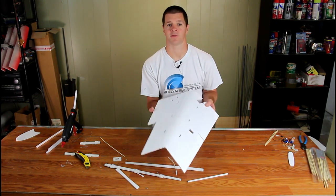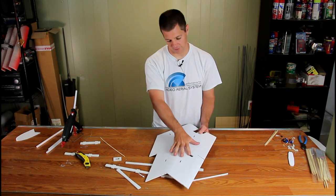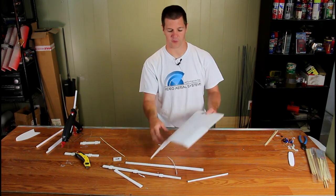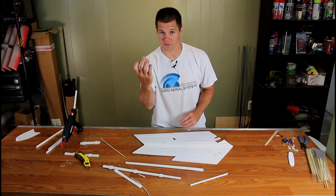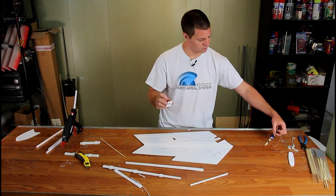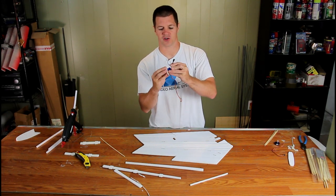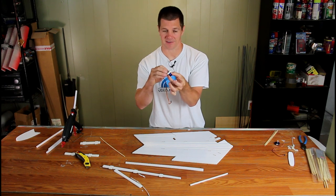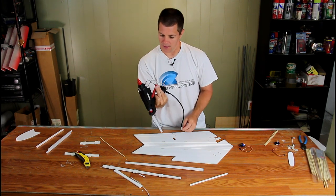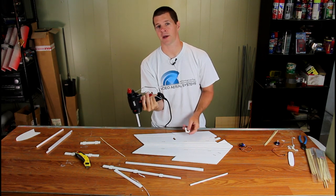In this model, the door here isn't mirrored on this side. I later updated the file so that it would go to the other side so your servos can go through. Speaking of servos, now's a good time to install the servo support — it's nothing more than a reinforcing door for your servos, and your servos should fit tight or reasonably tight to it.